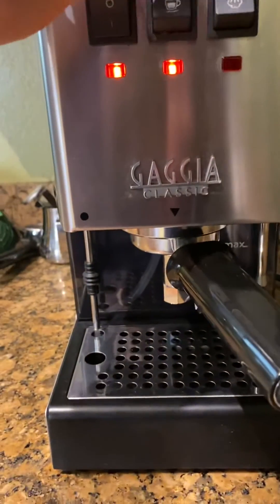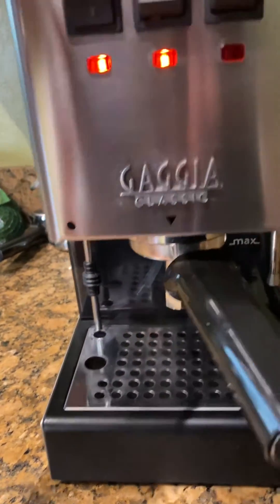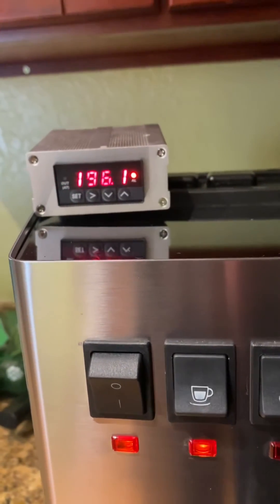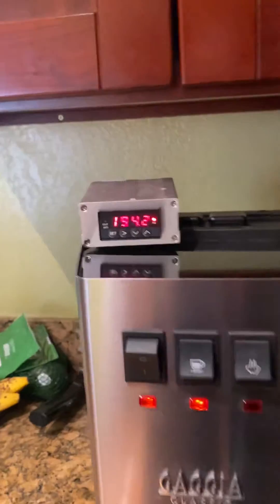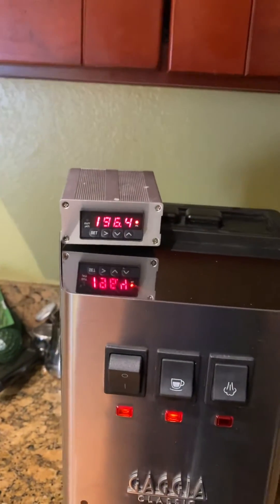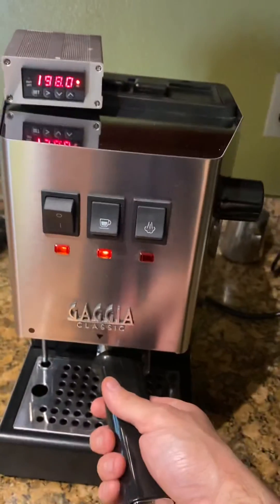Turn off the pump. The three-way solenoid valve is engaged there. The temperature is close — it was like 197.2, so there was about a variation of about two degrees. That's the whole purpose of having a PID, because it prevents the temperature swings from being very extensive. Just wanted to demo that.